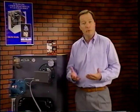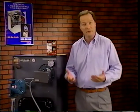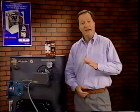The low limit is used to maintain a minimum boiler water temperature. The higher the low limit setting, the greater the quantity of domestic hot water available. However, a high setting also increases the standby heat loss, increasing operating costs. This means the boiler is maintaining a high water temperature while waiting for a call for heat. Thus, standby heat is lost through the flue, boiler jacket, and piping.